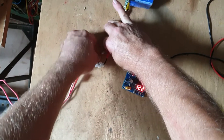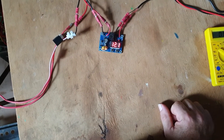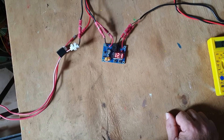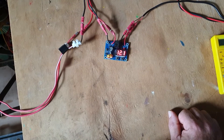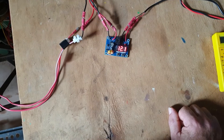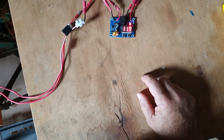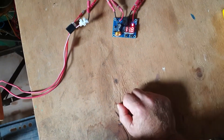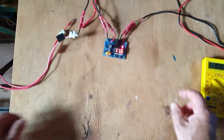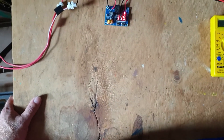Let's disconnect the panel. It's not the increase in voltage that switches it on — it's the time delay. There she goes. That was a time delay of five, which equates to something like 30 seconds. It's now bringing the voltage back down — we're pretending the sun's behind the clouds. The panel's not actually connected. I'll connect the panel again once we get down to 11 volts and it switches off.